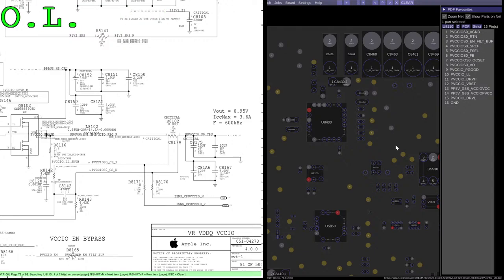And this is the feedback. Feedback, we're wide open. No, no, we're charging capacitors. Yeah, we're charging all the backlight capacitors with the multimeter, so that is fine. So the backlight driver is good on this. A lot of times we see the backlight driver dead too.